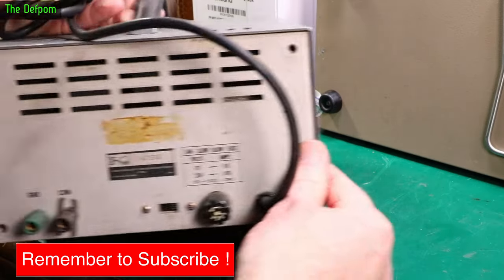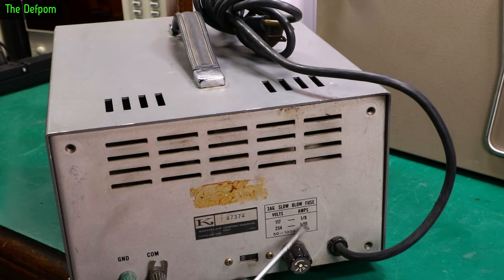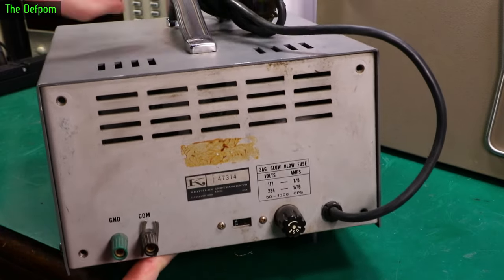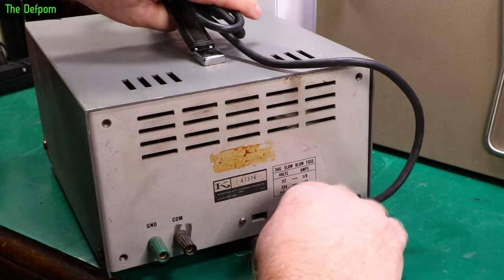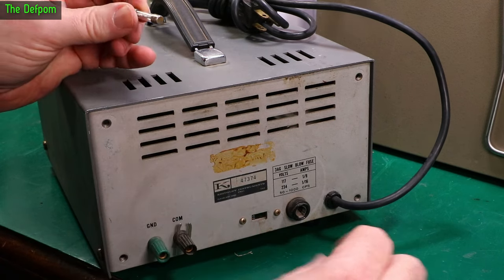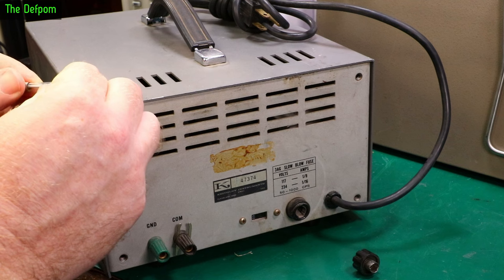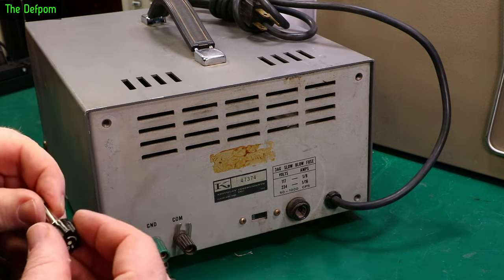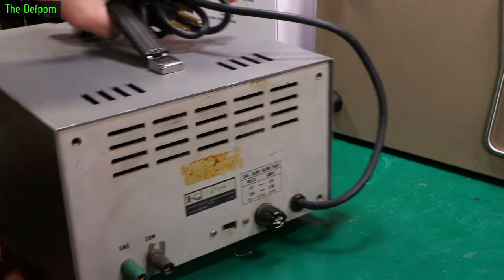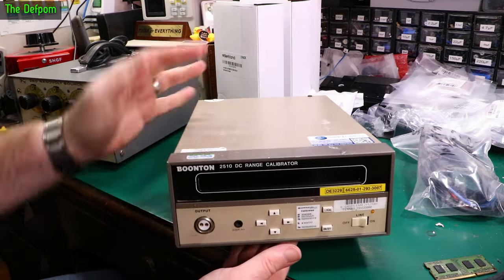I will do a video on this thing later on. Here's the rear panel — let's change the voltage before I forget: 230 volts now, and the fuse difference is negligible. You've got a ground and common terminal here which you can link together — sometimes you need to do that, sometimes you don't, depends on what you're doing. I should check the fuse — shouldn't just assume it's got the correct one in there. It looks pretty small. It's a 32 volt fuse — MDL type. That's interesting; it's not a 240 volt fuse. I'll have to keep that in mind when I work on this thing, though I don't think it really matters that much — this device is going to draw very little.